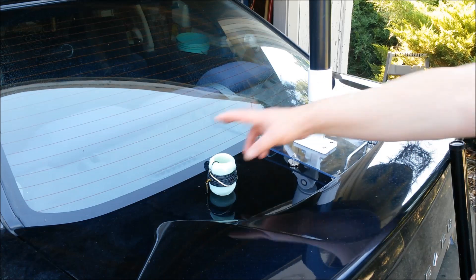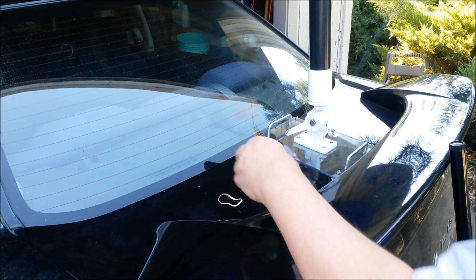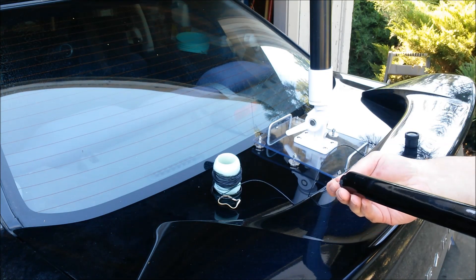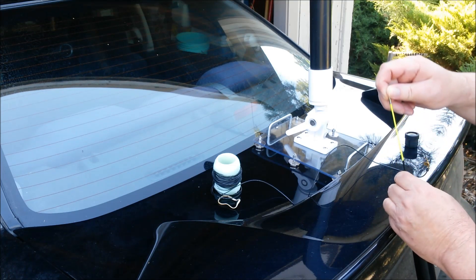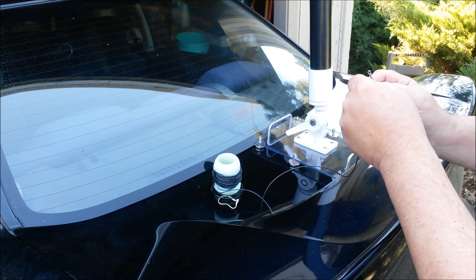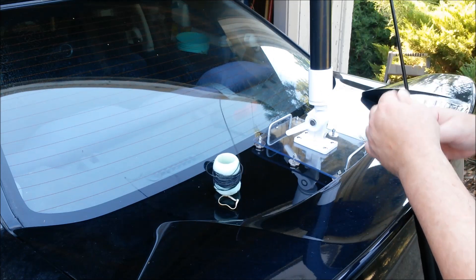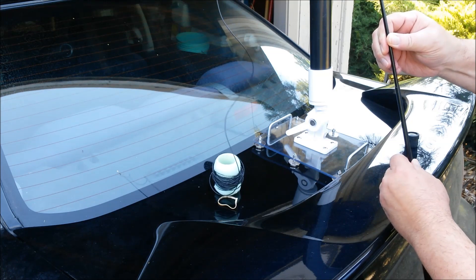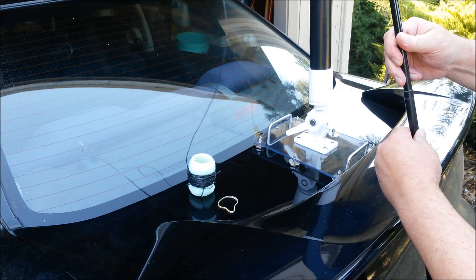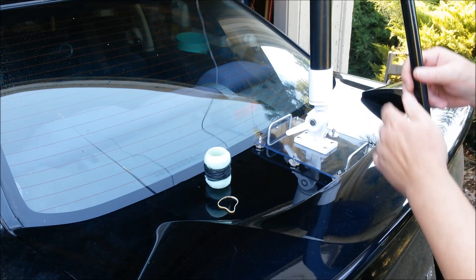Let's put this antenna in the air. This little three inch roller works pretty well for holding your wire and keeping it in place. Just take a few feet of wire off. Remove the cap from your Wonder Pole and the top section of the rod. The top section clips on with this bit of fishing gear. Now we're going to erect the Wonder Pole. Each of these sections locks together — when I lock the sections together I am turning the lower section only. This is to keep from wrapping the wire around the Wonder Pole. It's a lot easier to take down if it's not wrapped around the pole.